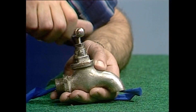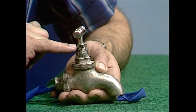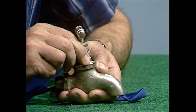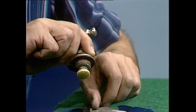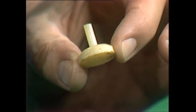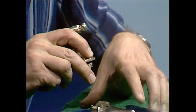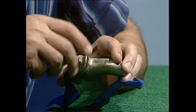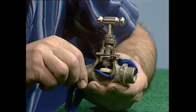That's the hole side. You turn it off at the mains, undo the tap a bit, and undo a nut — not that one, but that one. And if you did that, the whole business would come out, and it would bring with it the old, tired washer. Take that off, get a new one from the hardware store, put it in, and by screwing the whole lot back again into the tap, tightening it up and turning the water on, you'd have a tap that was once more a functioning one.